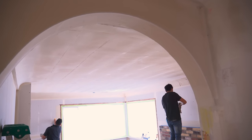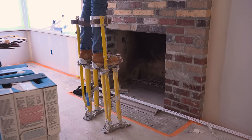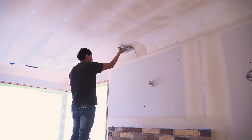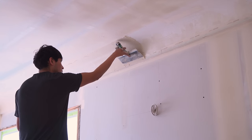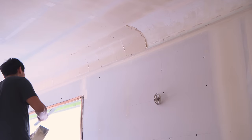You'll have to forgive my high school Spanish. It's not very good, but from what I can figure, the soap that they added into the mud was to prevent bubbles from forming, specifically when they're going over the top of the old plaster. It tends to bubble up, and this can cut down on the number of bubbles that you have to repair later.